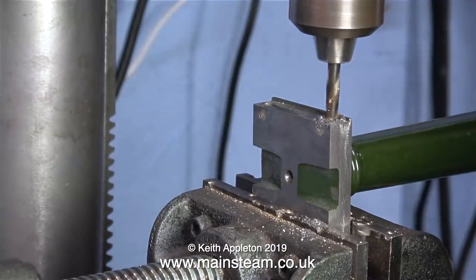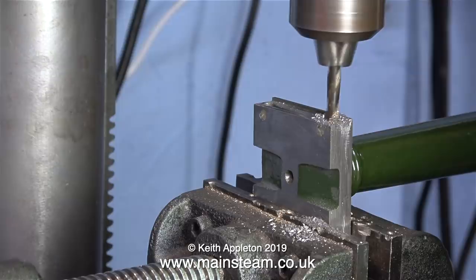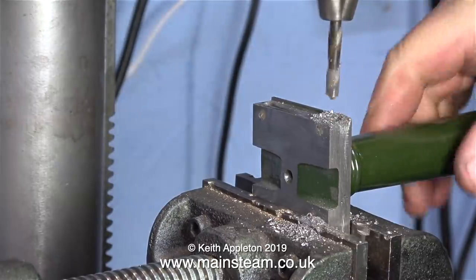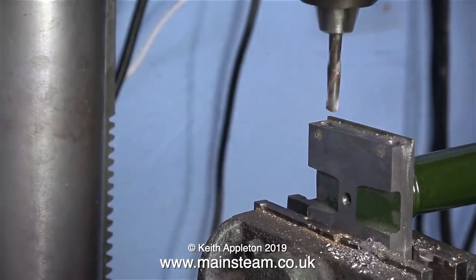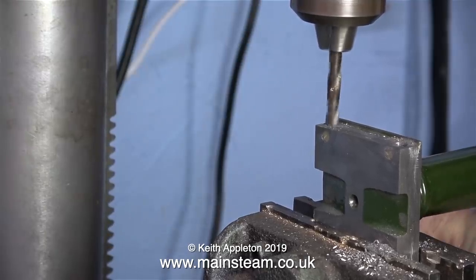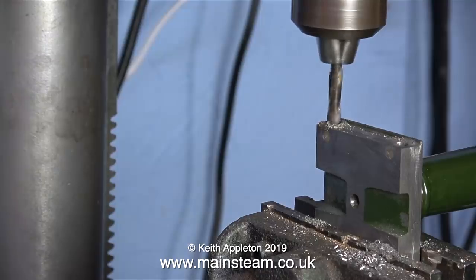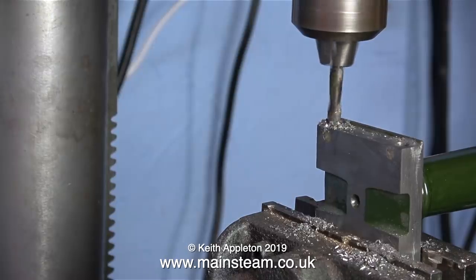So what I'm going to do is drill the holes a lot deeper, using a 7/32nd of an inch diameter twist drill, which is tapping size for a quarter by 40 threads per inch. Then I'm going to make and fit two quarter-by-40 threads per inch plugs, which I will screw into the holes. When you're plugging holes in metal, it's a good idea to try and use the same kind of metal that you're plugging. If you're drilling a hole at the junction between the new piece of metal and the old piece of metal, and one is steel and the other is cast iron, the drill is going to wander towards the cast iron, making it very difficult to drill accurately. I've used steel bolts to plug the holes at the top, but they're not going to get in the way of the bearings — I'm pretty sure they're not going to, anyway.